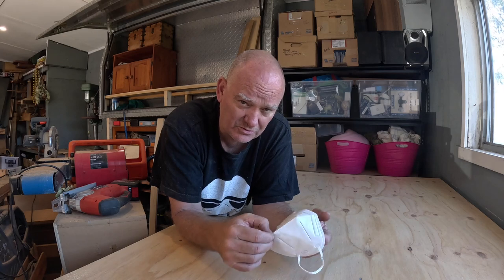Also, this new bench I've just finished, well, thought I finished, where I'm putting the pedestal drill. I need to put another layer, especially in that corner. And I think what I'll do is I'll turn the boards 90 degrees and run them that way, and I will put them at least in that corner section. I will put them through the thicknesser, not so much for the looks, but just to get them all the same thickness. That way the pedestal drill has a stable platform.